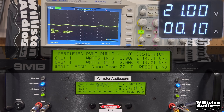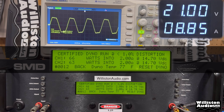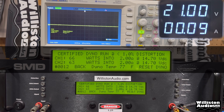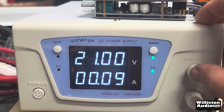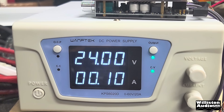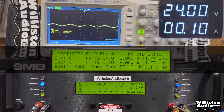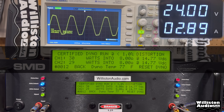Tests are at 1 kilohertz. Certified mode takes us to 1% distortion. At 2 ohms, 21 volts we get 66 and 63 watts. Now bumping voltage up to 24 volts — a lot of you are using 24 volt batteries. At 8 ohms it's rated 30 watts by 2, and we get right at the rating: 30 and 29 watts, so right at 30 watts per channel. Very good.